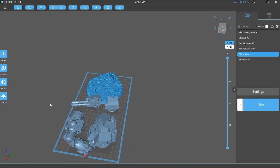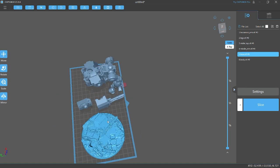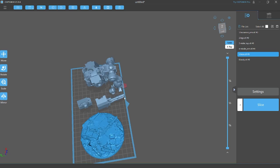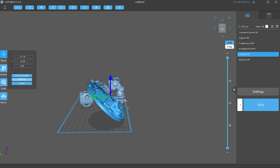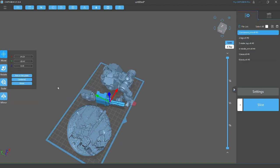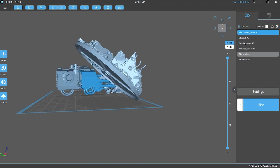You want to orientate each piece to give you the best chance of printing properly. With flat pieces, you want to be worried about bending. The circles where you plug in arms and legs — you don't want those warping or you'll have to trim with your exacto knife. For the base, we're just going to rotate this 45 degrees and leave it there. 45 degrees reduces the amount of weight at each angle that is being supported.